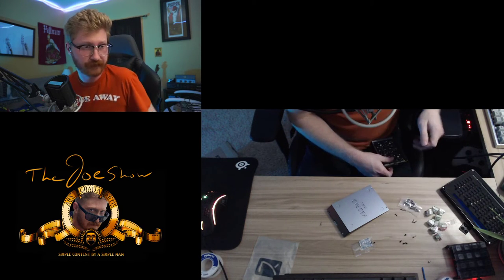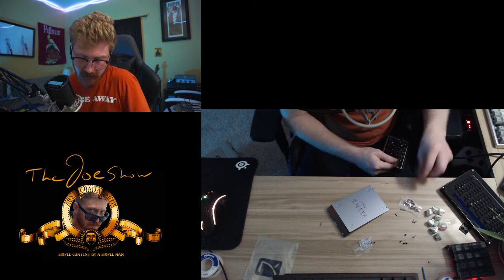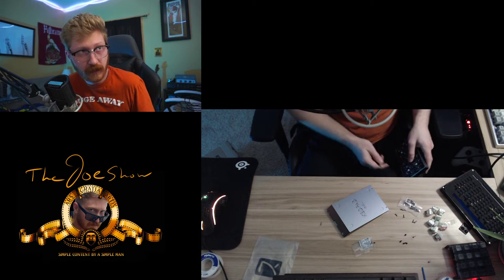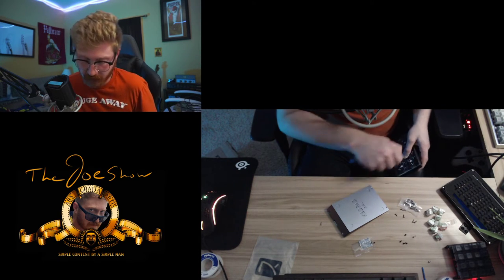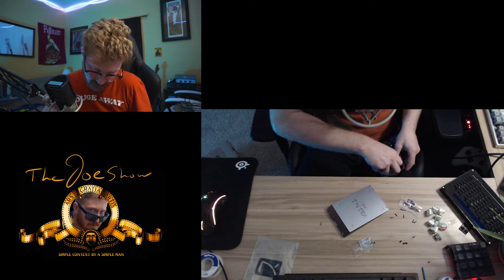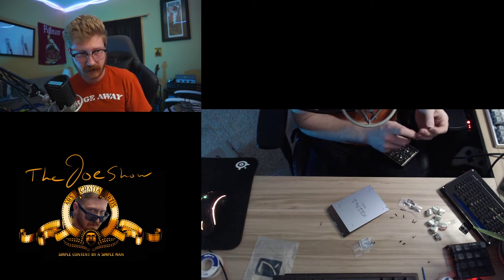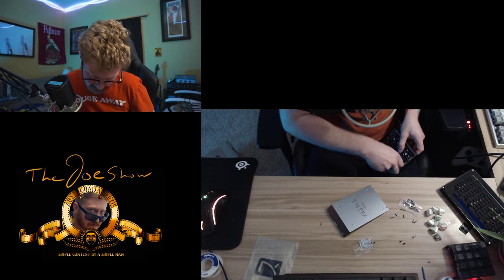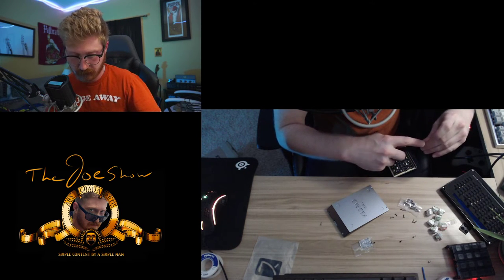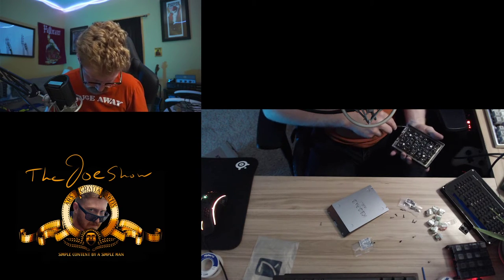I think it's because the silver screws are made to go in something where the spot for the screw is countersunk to the actual surface, so there's a tiny bit of a gap between the threads and the actual head of the screw. Yeah, I need to use the black screws for this. The little black screws have a completely flat base of the screw head. Nice. And the little black screws are ferrous, which is really nice.